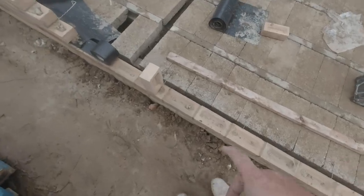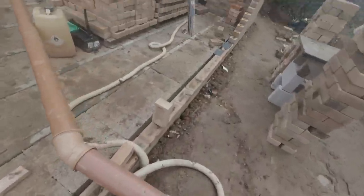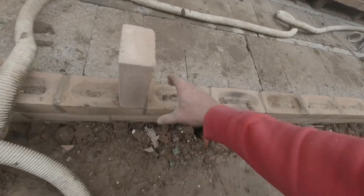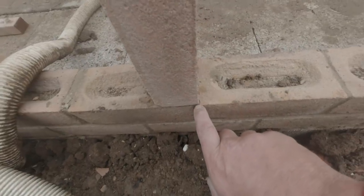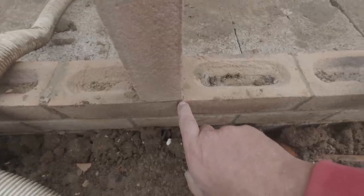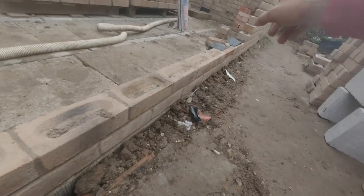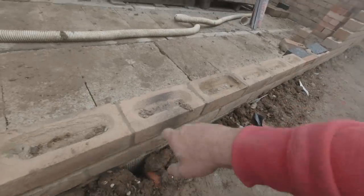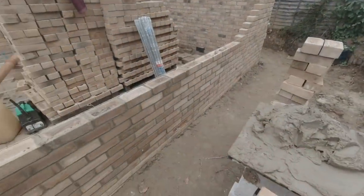I've marked out where the bifold doors are. They're coming from this part of the brick here. 3 meters and 10 mil gives us there. So that's what we're going to. 3 meters and 10 mil, giving the doors 10 mil, and then it works bricks. Lovely. Boom. So we'll run this bit in as well. And yeah, let's get on with this section. Oi, oi.